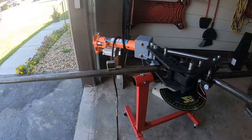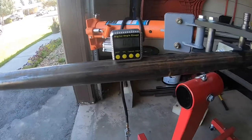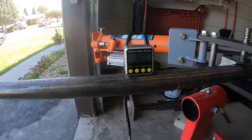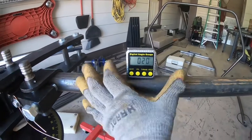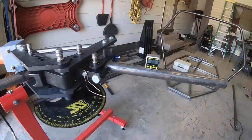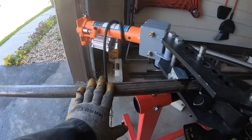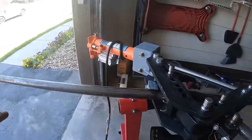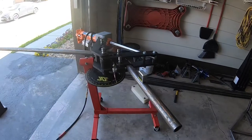I'll show you how I keep my angle. I've got this digital angle finder — I calibrate it to factory zero, then move it over to the tube on this side. It reads about 0.2 degrees, which is nominal. This shows both tube sections are at the same angle, so when I move to the next bend I'll zero it to this reading and make sure the bends stay on the same axis — avoiding the mistake I made with the main hoop.